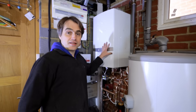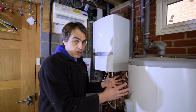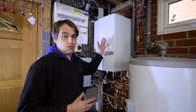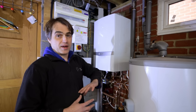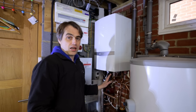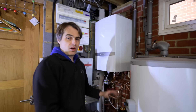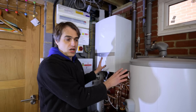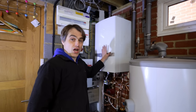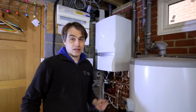What we have here is a system boiler with an unvented cylinder installed in a typical S-plan configuration. The boiler doesn't know what it's doing, just being told by the zone valves to fire, and it fires — that's hot water and heating at the same time. There are radiators upstairs and underfloor heating downstairs. The boiler always fires at the same temperature, runs inefficiently. It's a 37 kilowatt boiler — about four times bigger than this property really needs. This property could do with an 8-10 kilowatt boiler.